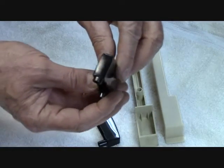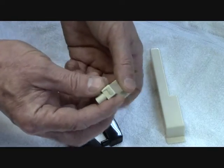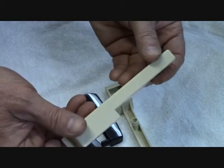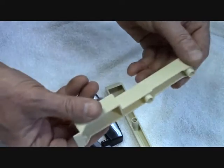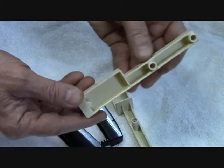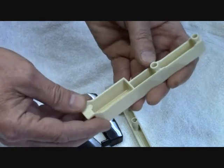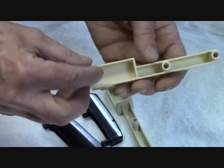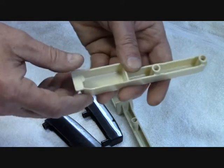If you cannot see that sprue mark, you have a thermoset part. The same applies to the white keys — if you look on the back of thermoset white keys, you will notice it's smooth all the way around. On the inside of the part, the corners on a thermoset part are usually rounded. You usually do not see any sharp corners on the inside because a sharp corner makes it more difficult for the two mold halves to come apart, and it creates a section more prone to breakage.